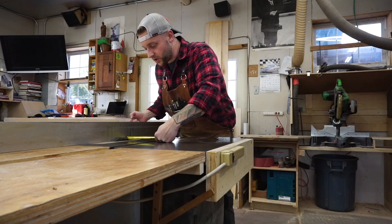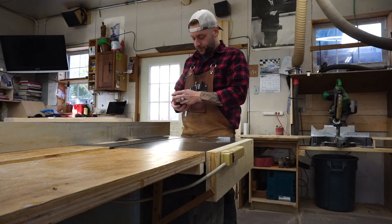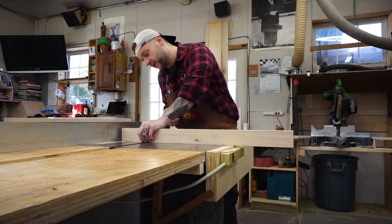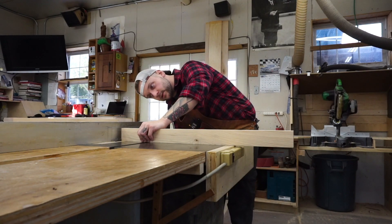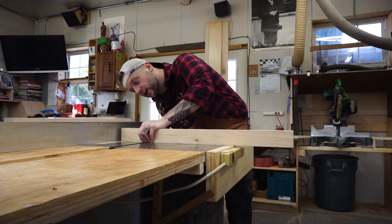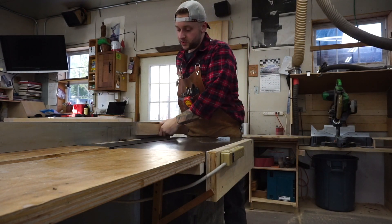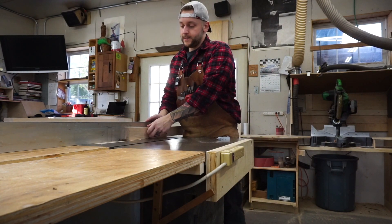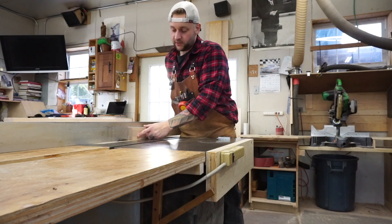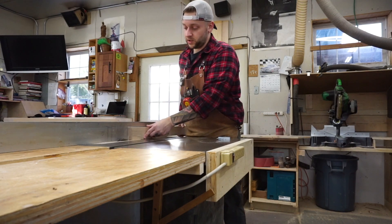We got 11/16ths and we'll give it just another little tap because we're going to creep up on this. The way to set your height is to just take the piece and put it up against the blade — a little easier if you have the fence out of the way first. We're going to leave it a little bit low and creep up on these final dimensions. The reason we're setting it up this way is that if the board comes away from the fence, we're cutting into our waste — versus the other way where we'd be cutting into the piece we're trying to keep. So I think that's a really good tip.